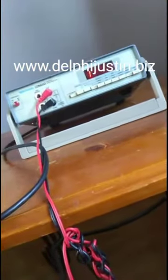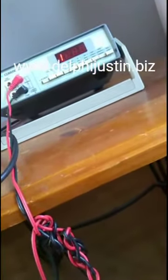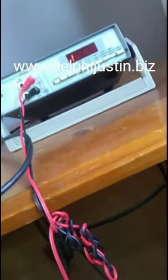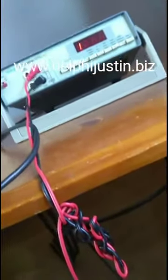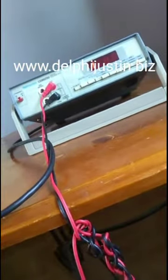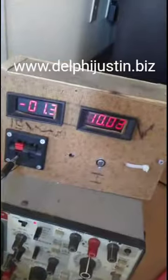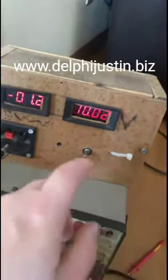And if you don't believe me, we'll go to the oscilloscope and try it on that one. We'll try putting 10 volts into it and see if we get 1 volt on the 1 volt per division, to see if the line stands on 1 square. Let's go ahead and do that right now. Okay, I've got the probe hooked up to this wooden power supply of mine that I built a long time ago. Anyway, it's set to 10.03 volts.